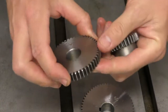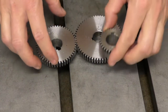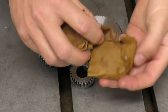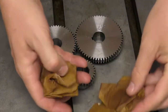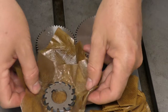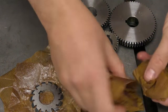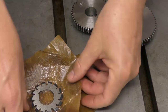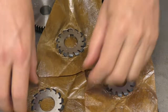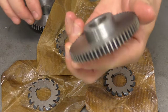When you're gear cutting, to make things easy you can buy gear cutter sets. You can buy fairly inexpensive sets of gear tooth cutters off eBay from China. I bought a set because I didn't have diametral pitch 20 - for about 90 or 100 Australian dollars you get a whole set of gear tooth cutters. The ones I need for this job are these three out of the set.